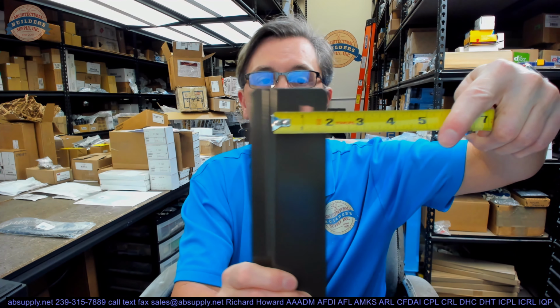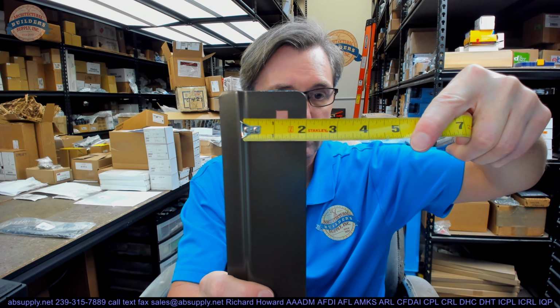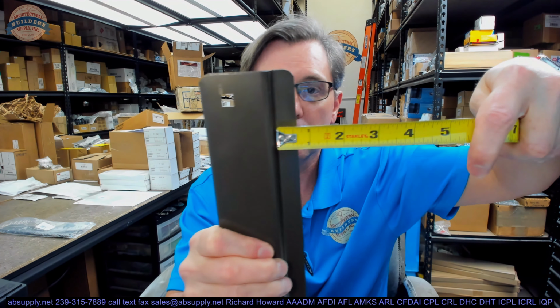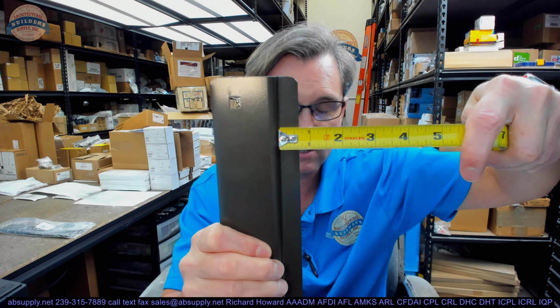The other thing to know is, will this space over far enough on your door to where you can mount it? So from where that offset starts, it's about 1 1/4 inches to where the center of the bolts are. Okay. Then from there, it's going to wrap over the face of your frame nominally about 5/8 of an inch. So if there's a confluence of that working for you, then it's possible that this is going to work.